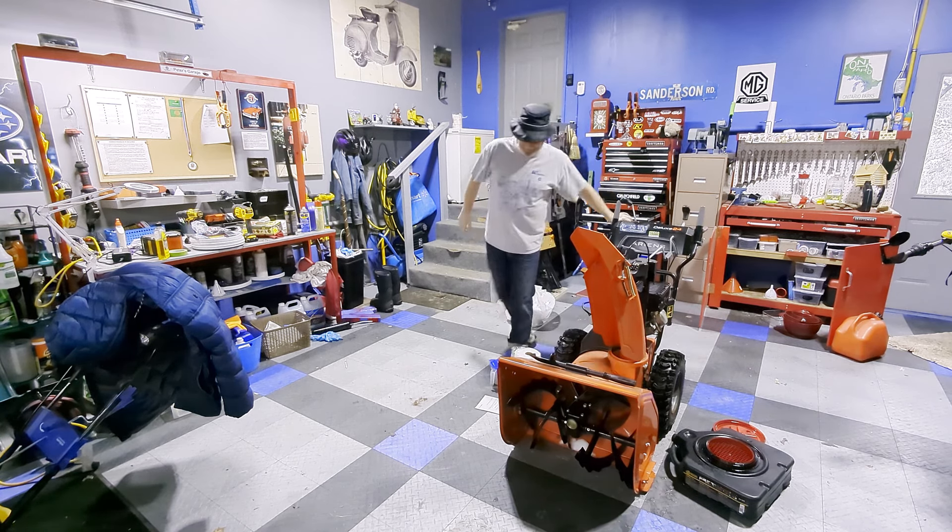Some final things — I'm going to remove this cover. Here we have some plastic with a metal roof. I'm going to use some spray lubricant here to keep it moving. I'm also going to use this lubricant on all the springs under here and the spring on the chute. There are a couple of springs under here and levers that you want to get into the joints — just move them up and down.